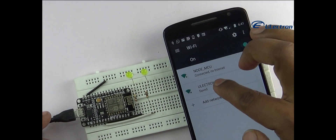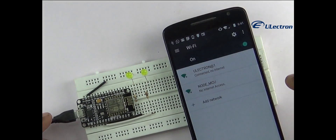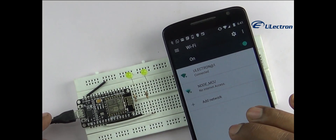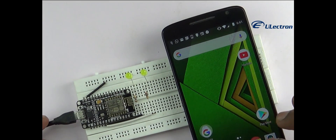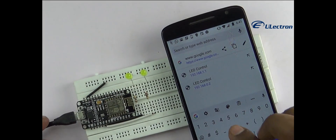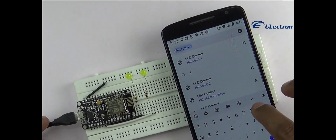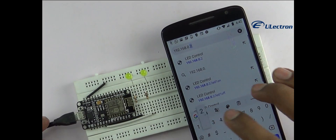Open your device Wi-Fi and connect to your network. Next, load up a browser and point it to the IP address shown on the serial monitor. The NodeMCU should serve up a web page showing the current status of the LEDs and two buttons to control them. You can also see the status of the NodeMCU's GPIO pins on the serial monitor.